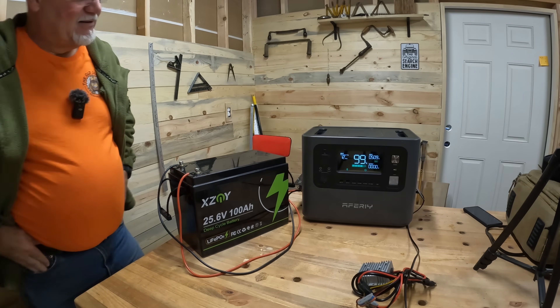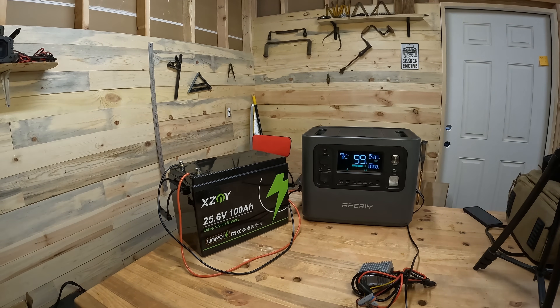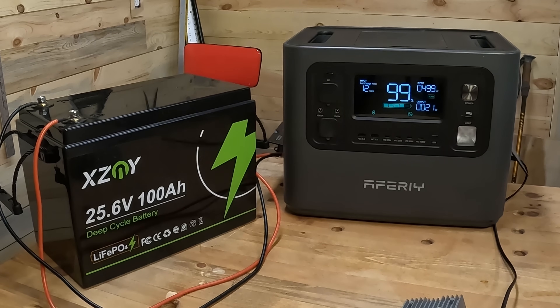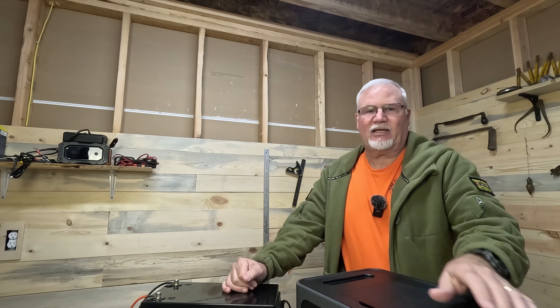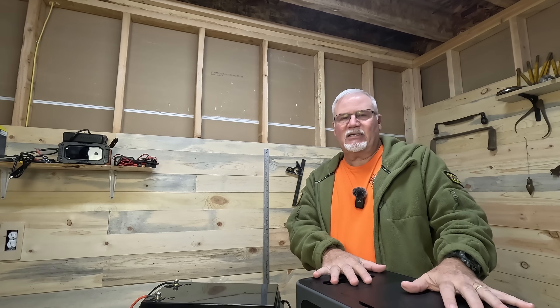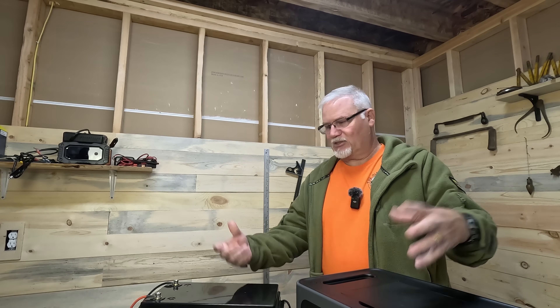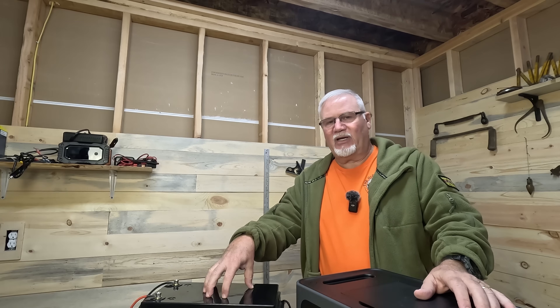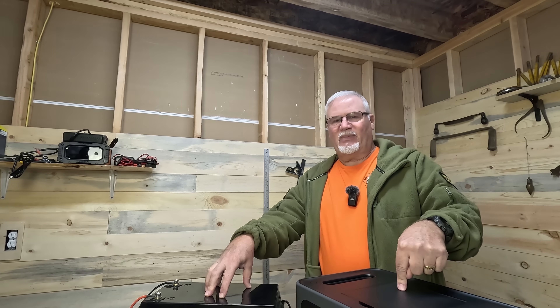We're still pulling 500 watts, and output is now 21 watts to run the light. Full charge time is 12 minutes, and we're actually running that light pulling over 20 watts. By plugging this into the solar input, the unit doesn't care — all it knows is that it has 25.6 volts coming in, it can use 20 amps of that, and so it uses that to get 500 watts of charging. That's 2,560 watt-hours of capacity it can fully use before it touches the battery in the power station itself.